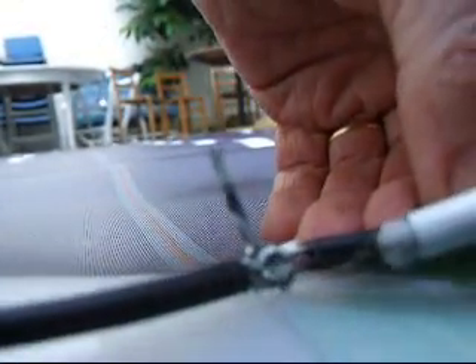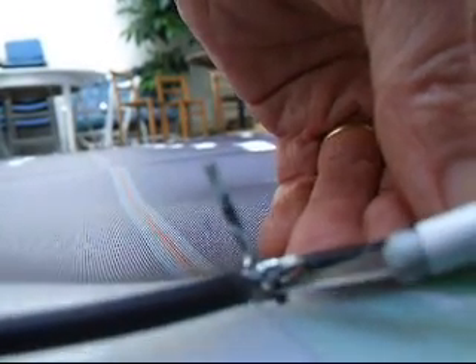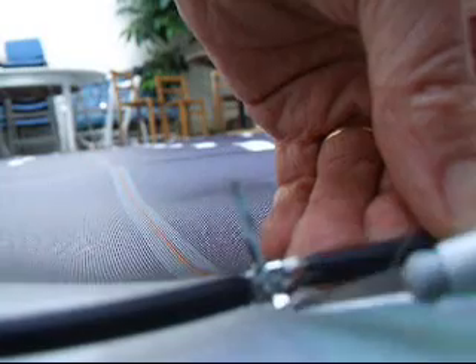I'm sorry this isn't focusing very well, but what I've done is to split the wire here - the strands - so that there's a hole. I've pushed one foil through the middle and over the top, and one over the top and through the middle, so that regardless of how the solder takes to the wire - and after all this could end up a dry joint - my soldering iron is probably underpowered.